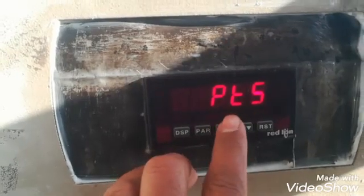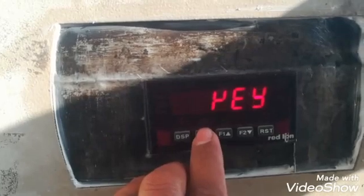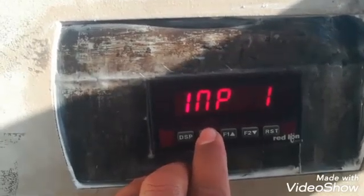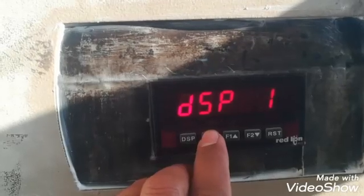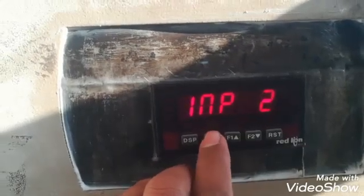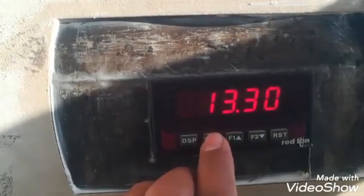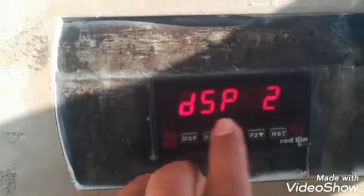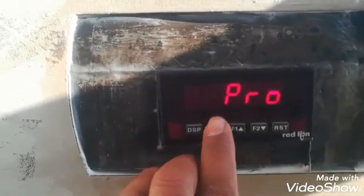I have already shown you the main parameters: Input 1 and Display 1 — at a given input millivolt value it will display the corresponding reading. Input 2 at approximately 13.3 millivolts will display the maximum value, which is 50 tons in this case.